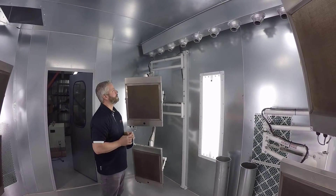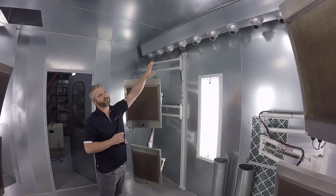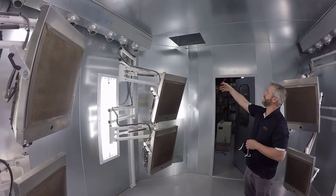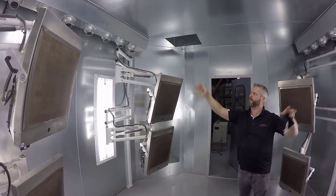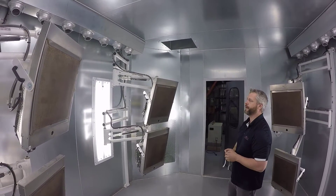Within the Sunspot booth, what we have here are a recirculating air system. The exhaust is drawn in here — this is the intake for the recirculation air — which would then blow through these chambers in the top and create circulation to spread the heat around.